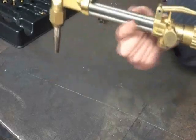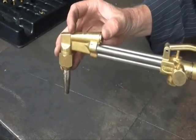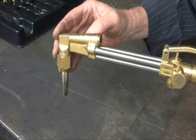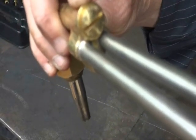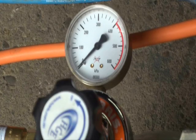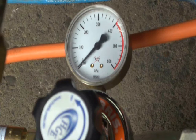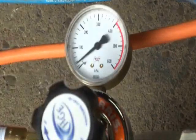The cutting attachment is a three-tube design so it's strong. It has the mixer built into the head, and at Harris we recognise that different fuel gases require different mixing arrangements — this particular cutting attachment has a propane mixer fitted to it. The Harris system uses a Venturi mixing system, meaning the fuel gas is mixed very efficiently for maximum economy from our fuel gas and oxygen. To run the Harris cutting torches and gouging tips we require only 1.5 kPa at the tip, which at the regulator is less than 20 kPa.